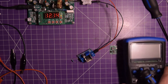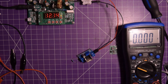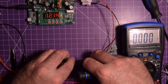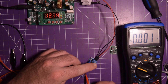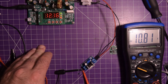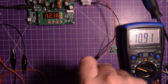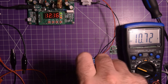I need a smaller screwdriver — there we go. Now I need to check the actual output voltage, so I have my multimeter here. Ground on this side. There we go — 10.9 volts. I need to go the other way; it should start falling.